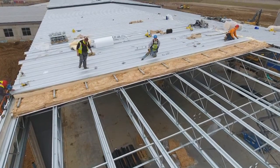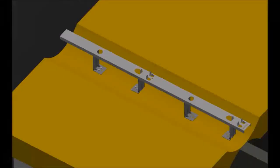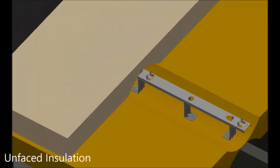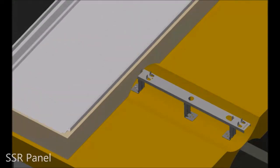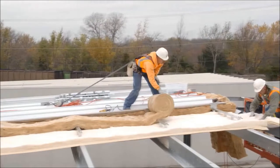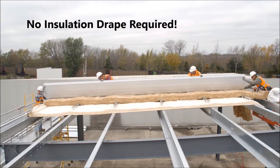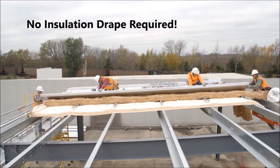This system includes a proprietary 5-inch by 48-inch insulation bridge to provide additional space for insulation between the roof panels and the building structure. The bridge is made from sturdy 22-gauge galvanized steel, and when combined with VP's SSR clip offerings, can lift roof panels by up to 7 inches above the secondary structure, creating enough space for two layers of blanket insulation for a U-factor performance as low as .029.